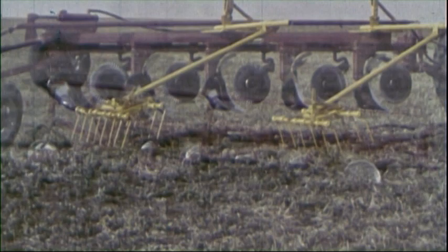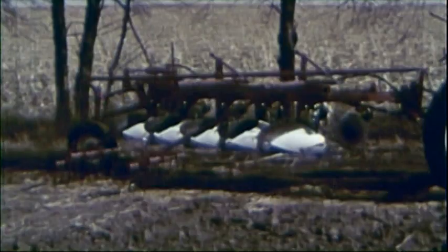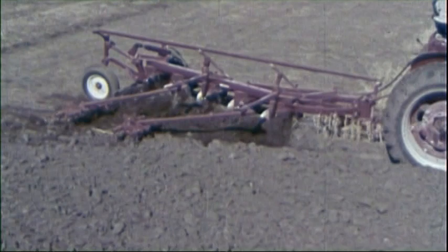When you reach the end of your furrow and lift to turn on the headland, the plow mulcher does whatever your plow does. You can turn free and easy with no chains or cables to worry about. When you drop your plow back into the ground, the mulcher goes to work at the same time, breaking up clods simultaneously with plowing of the ground, with no pulling of trash in from the headland.